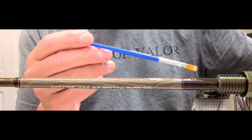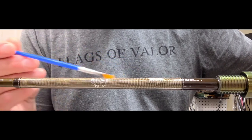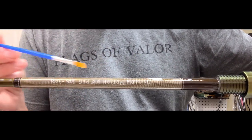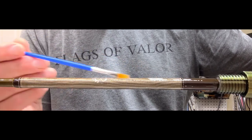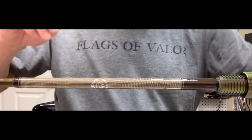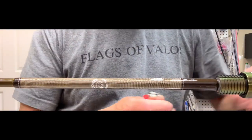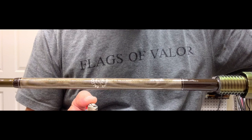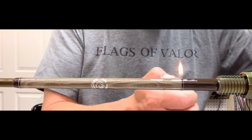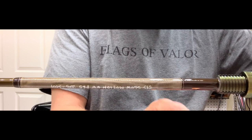And this is the last thing I do. I'm just going to do some long, really light, almost tickling strokes, with very, very light pressure, just the weight of the brush, to even out. And you can see on the dark brown section, dark olive section to the right, you could see screw thread looking marks or trails from the brush, and they're gone once I've done those flat strokes.